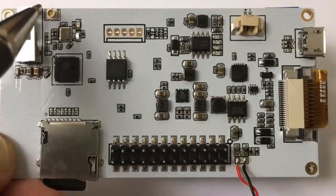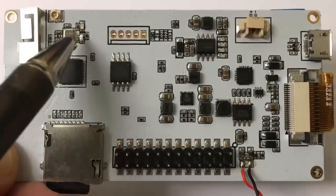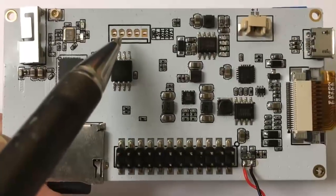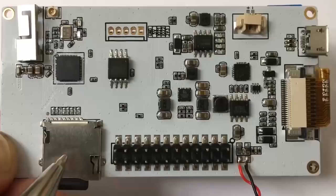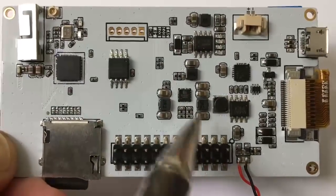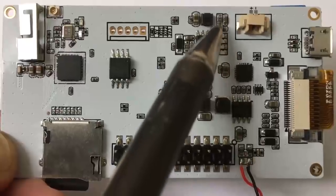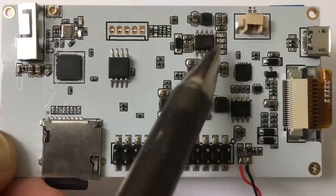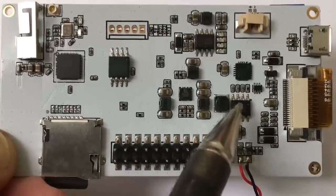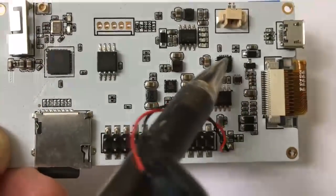There's an external antenna connector, a 40 megahertz crystal, a red power LED, a green user LED, 32 megabit flash memory, a Grove I2C connector, an SD card reader, a set of I/O pins, a LiPo connector, a battery charger, and four status indicators at 0, 25, 75, and 100 percent. There's also a micro USB display connector, audio amplifier, and a speaker connector.